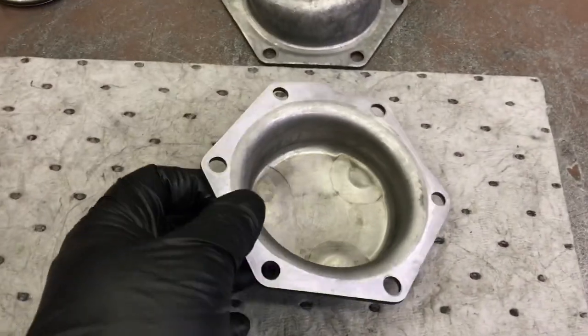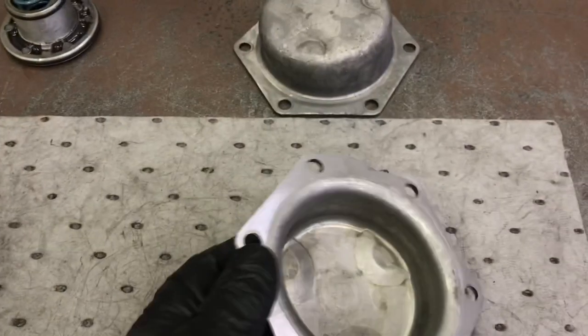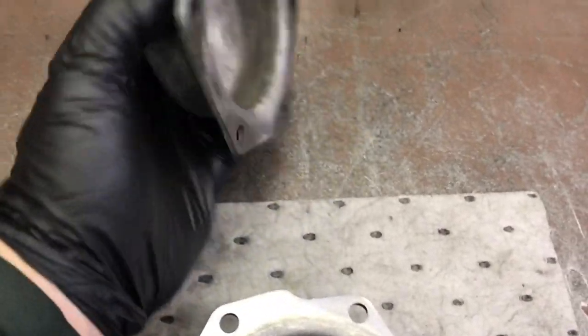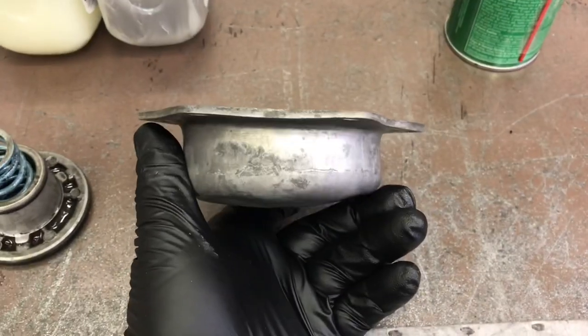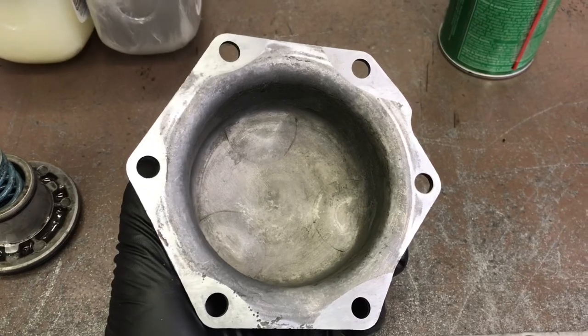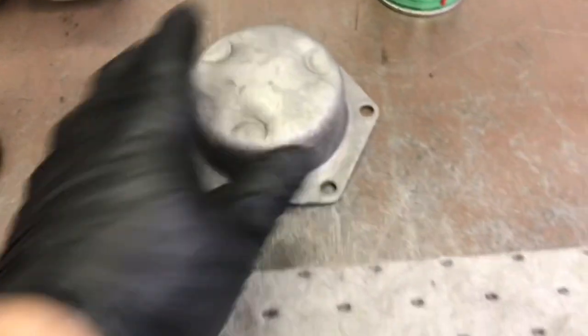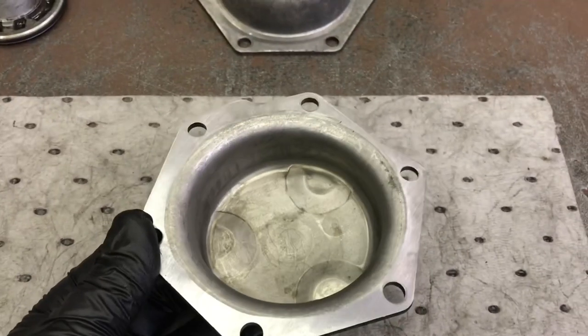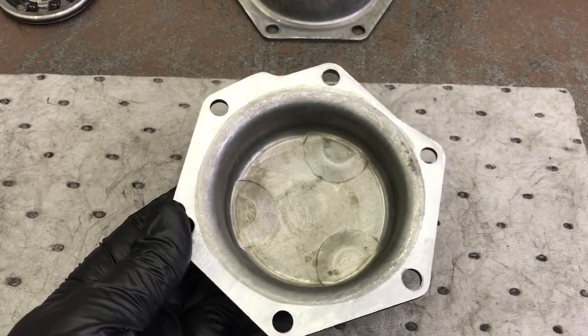I always take the rear servo cover and just touch it on my belt sander. Earlier I grabbed one first, sanded for almost two minutes, and gave up — it was bent. You wouldn't know that by looking at it; it looked fantastic, but it's junk. This second one is perfect — that's maybe 10 seconds on the belt sander, just touched it a few times, so I know it's flat.